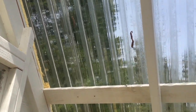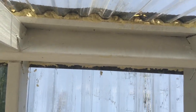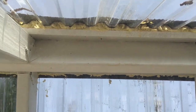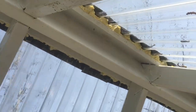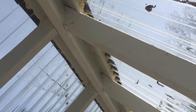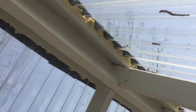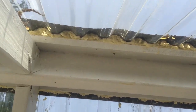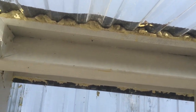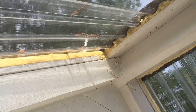Then after installing them, I went ahead and added on an L-shaped fiber ridge cap that goes all the way across, overlaps in the middle, all the way across the ridge, to seal it in so there won't be any leaking. I also sealed it with some caulking on top, and then came back all the way around in all the crevices and all of the corrugated gaps with a spray-in foam that expands. It starts off light cream colored, and over several months it's turned yellow.